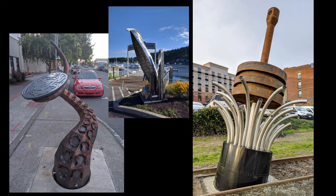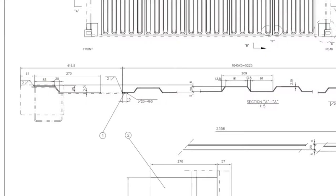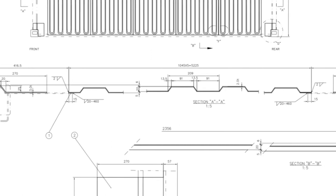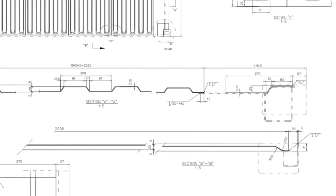But the one thing you don't want is to leave it sitting in water, because then it will just rust like normal steel. So the roof can't just be flat and it definitely can't bow down in the middle. The standard solution is to have a slight arch in the roof from side to side and to emboss the steel with stiffening features.